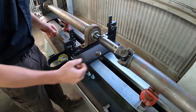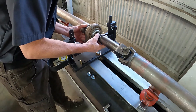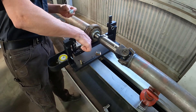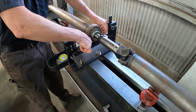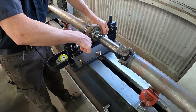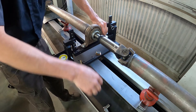We'll take these spacers out, and that'll drop the shaft onto the base. At that point, you can just make sure it's centered up nice. Pull that down, and this will give us a balance point here. Using the strobe, we'll be able to find out where to place the weights for the center of the driveshaft.